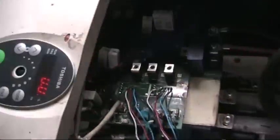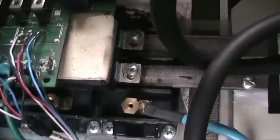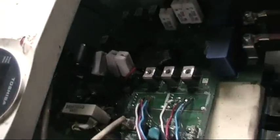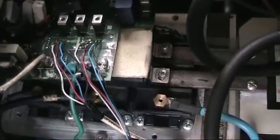The gate drivers are actually rated to drive 1200 volt and 100 amp IGBT modules, which is exactly what the MG100 IGBT modules are. So I changed the gate drive resistors — three for the lower stages and three more hiding under there for the upper stages — to give the proper gate drive resistance so it will switch the IGBTs on and off fast enough to run at their full rated current of 100 amps.